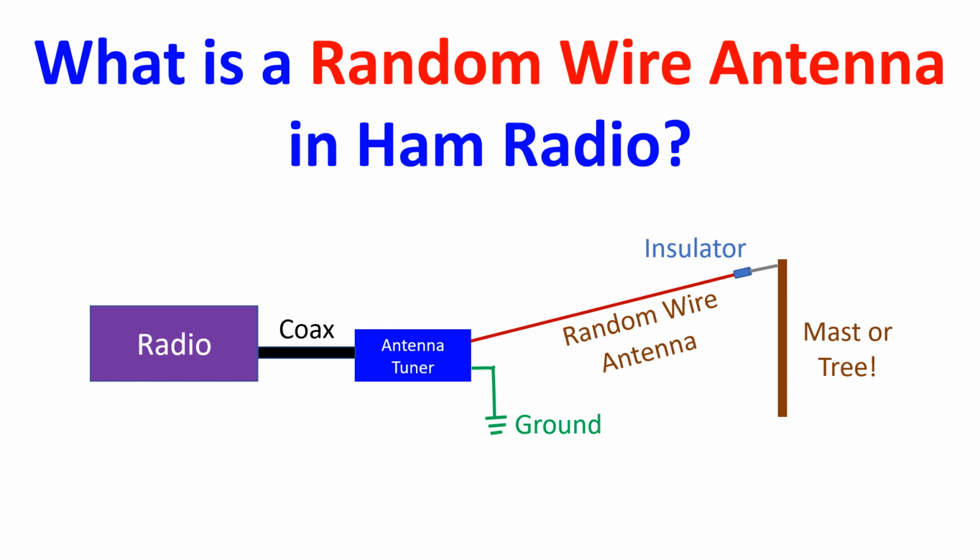Ideally, it has to be a quarter wavelength of the lowest operating frequency. As it is quite long for 80 meter, it can even be looped around. A counterpoise will balance the antenna system from an electrical standpoint. A random wire antenna is sometimes deployed in a zigzag fashion if there are space constraints. But this will reduce effectiveness and make theoretical analysis quite difficult.